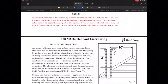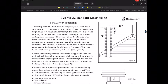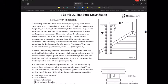Now the code book, just like these systems, because of the resistance of these lining systems that are corrugated and not smooth, they specifically want you to reduce the table values by 20%. And there's a lot of similarities on that, and that's primarily off the main normal system. As far as the installation of it, I'll chat a little bit about that.